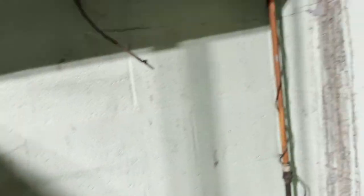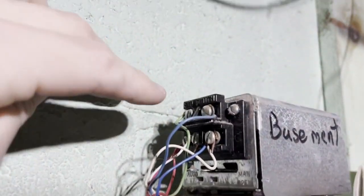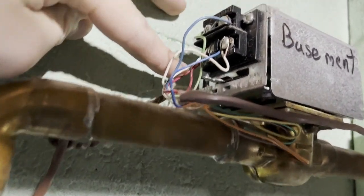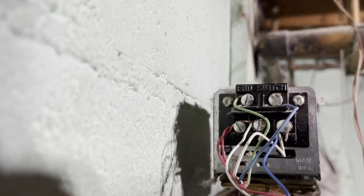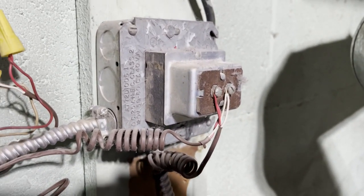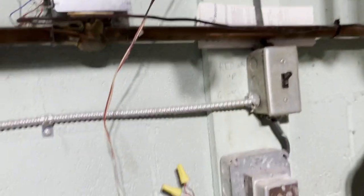The thermostat wire comes in right up to the valve. If you have these Honeywell zone valves — they're pretty common — you'll have control wires on top that feed through to the boiler. On the bottom-left two screws you've got red and white coming from your thermostat: red farthest to the left, white next to it. Then you've got blue and white together, which is your common or C wire — that's 24 volts back to ground from the transformer.